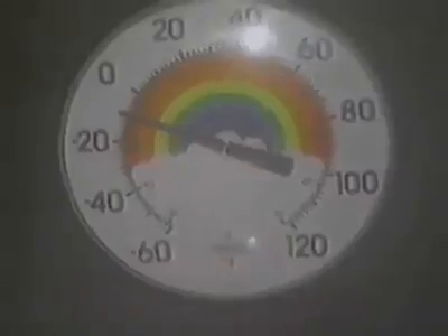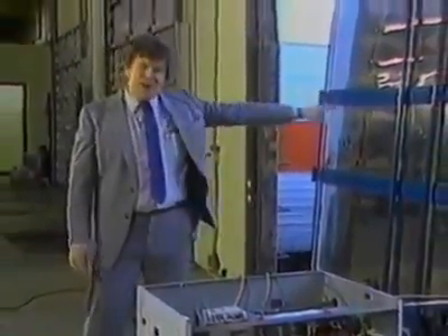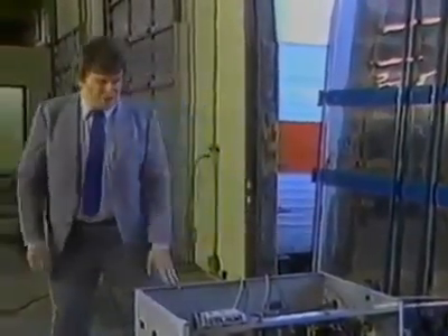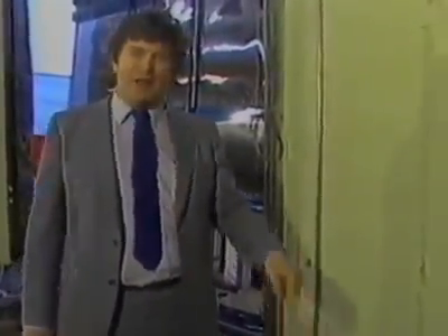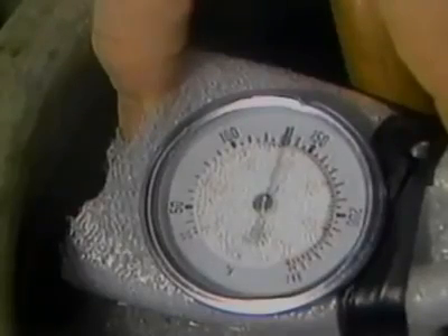I'd like to show you a little demonstration of that. As you can tell, it's cold in this refrigerator. Right inside here, we've got our evaporator collector sitting here in a little array, all equally spaced. It's 10 degrees below zero inside here. This over here is the processor — the business end of the proposition. What we're doing is taking freon, running it into the freezer, pulling the heat back out of the freezer, running it in here, and making hot water. We're delivering the hot water to a little crock pot. All the hot water in this crock pot is actually being made hot by the heat we're pulling out of that freezer in dead air space. The water is 130 degrees — that's hot.